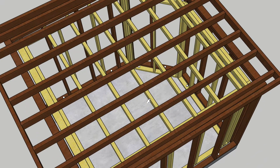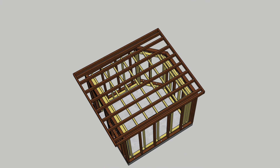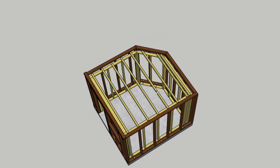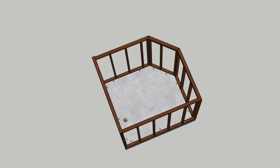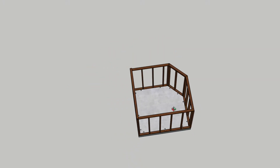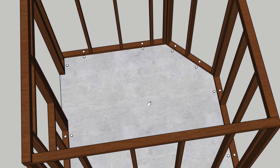When constructing the roof there are a couple of important things you'll need to consider, including the size and grade of the timbers, their spacing, as well as the overall slope of the roof. You can use a resource known as span tables, and I found a really helpful site which I'll include a link to in the description. The first thing you'll need to know is the clear span, or the unsupported distance between the two walls — in this case for my build it's 2.8 meters.